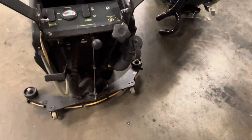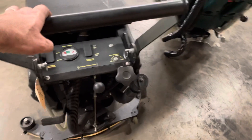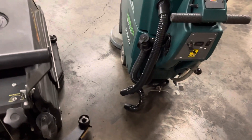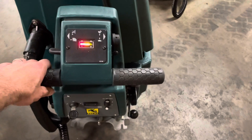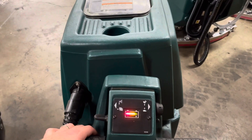Much simpler machine. Most of the small machines are brush-assist, meaning you push the machine when the brush isn't down, and when the brush is down and engaged, it gives a little bit of forward propulsion. Some of them do have drive control to aid. If you're working a really large building, propulsion is a must.